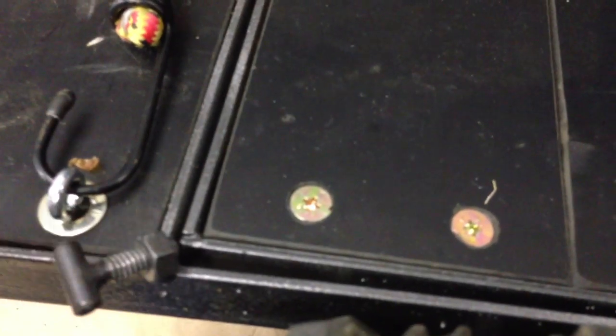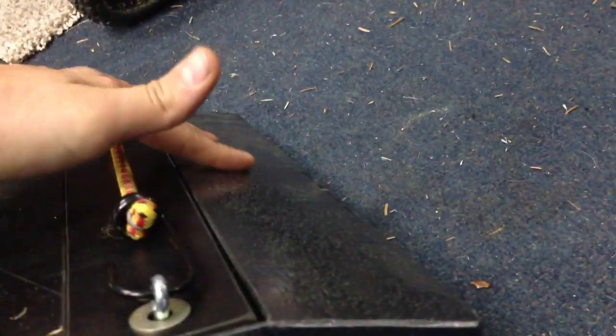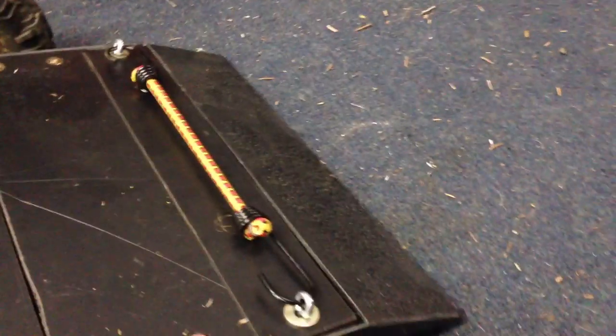I'll show you how the tilt-deck kind of works from underneath. So I'll go ahead and unscrew it from the top. See, it opens up. And to keep this tilt-deck from caving inward, there's this metal stopping plate right there so that it doesn't go all the way in — it stops right there. At the rear, I cut this steel right here at an angle so I could lay another plate on top and have it be tilted. So it works as a good tilt-deck.